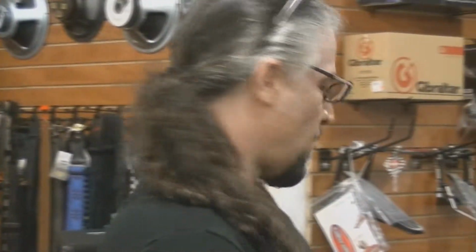Another cool mic I just wanted to show people. This is a large condenser also. It's an Octava, an older one. They used to call this the coffin mic. And it had an inherent problem. It had a grill here and a grill here that I have removed. It had the grill plus a double screen in it, and what that did is kind of kill the highs. Then they put a plastic diaphragm cover on it, which is supposed to bring back the highs.